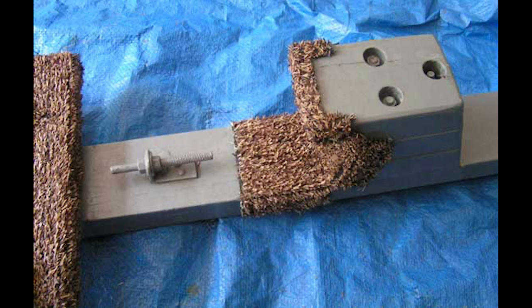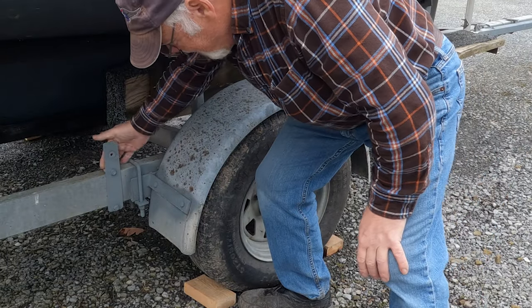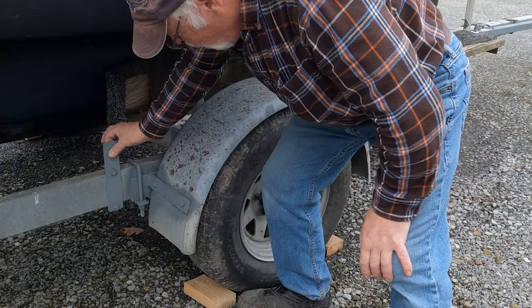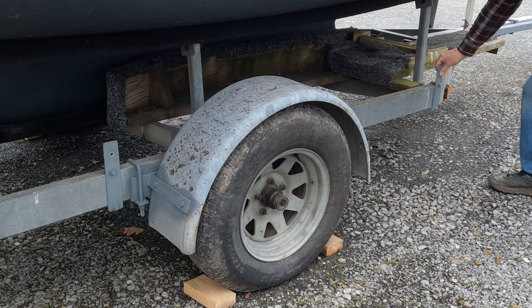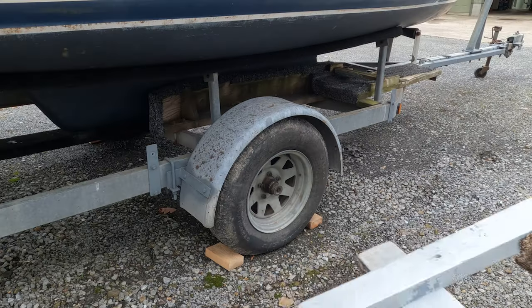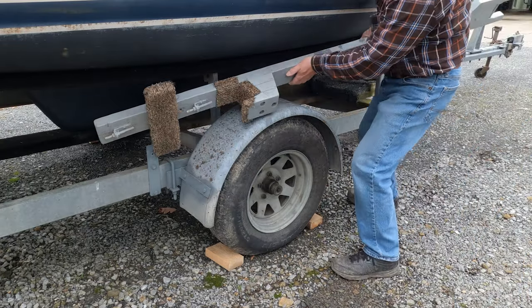Noting the problems with the first design, I added the hook for the top of the stern to carry the weight of the mast and not the rudder gudgeons. The hook takes care of the twisting motion on the pintles, but not for the fore and aft motion. So I added the crossmember between the gudgeons.